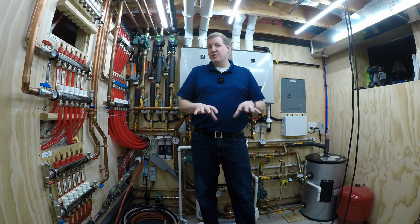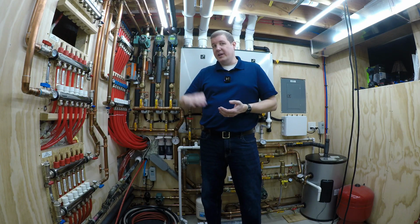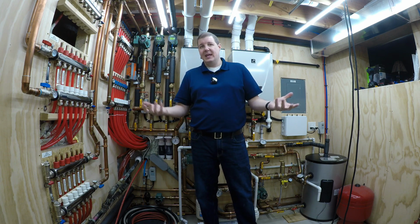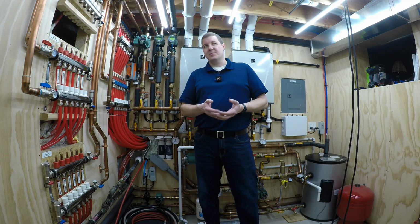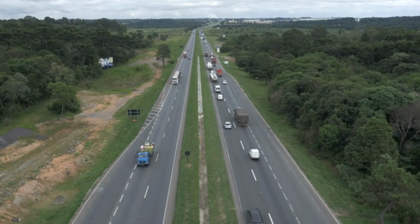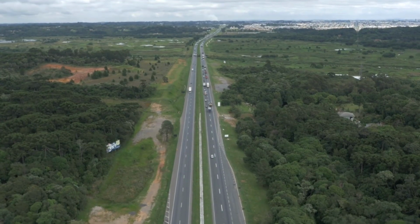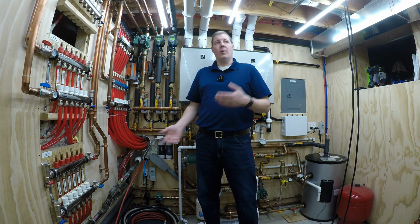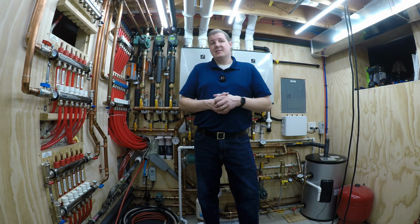We're using 250, 300,000 BTUs, where once it's up to temperature and running, it's typically 100, 130, in that range depending on where it is in its 15-minute run time. If it's towards the end, sometimes even less than 100,000 BTUs. It all depends. So the longer you run the system, the more efficient it gets. I like to explain that just like a car going down the highway. Yes, from a start, you use more gas to accelerate it up to 55 or 60 miles an hour. But once you get there, you put the cruise control on and it just sips fuel as it goes along. That's exactly like this.